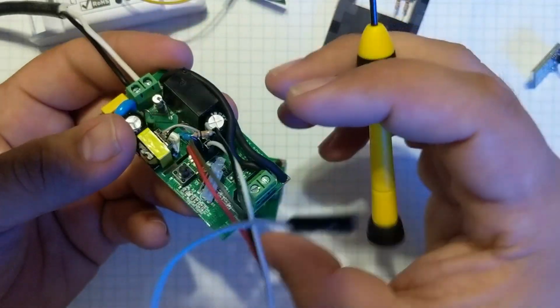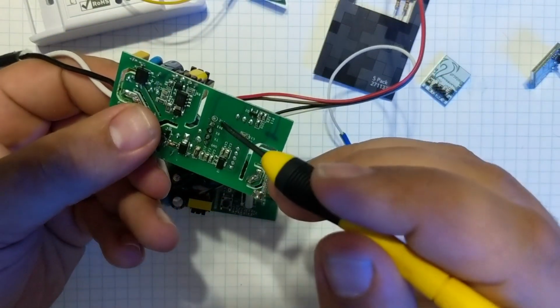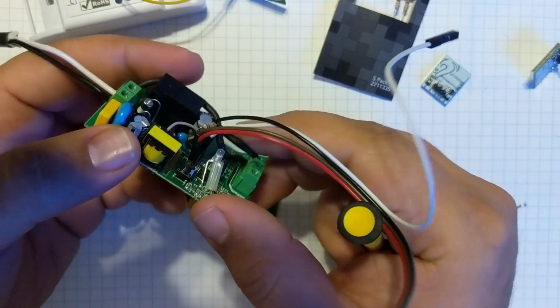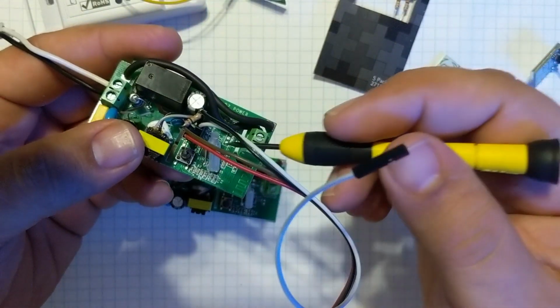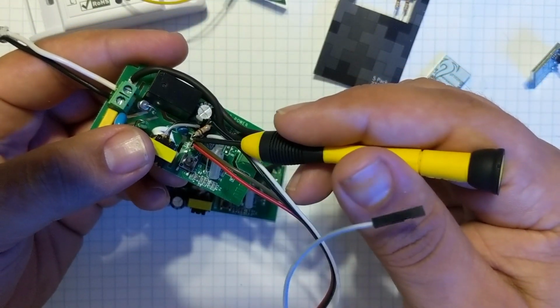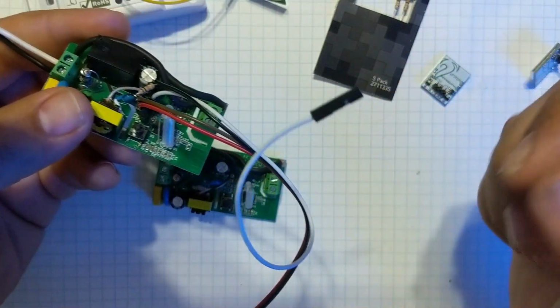Yeah, so that's all you need to do. Then your LED wire will solder down to the TX. So you'll use all four. Again, output must be on RX, and your resistor must go from output or RX to ground. And ground obviously is the same.